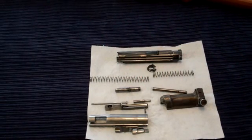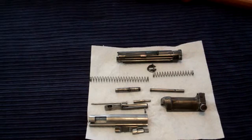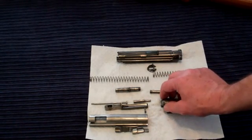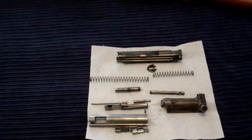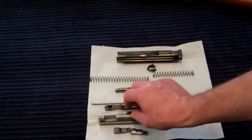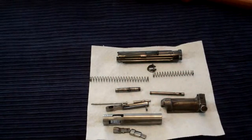So this is your whole assembly — the bolt has been completely field stripped at this point. Now you can do some cleaning and, even more important, inspect all parts for wear and tear, especially breakage, because by the end of the war the material quality was pretty bad and some parts tend to crack under stress. If you shoot your G43 a lot, always inspect the bolt carrier areas and also on the bolt where the locking lugs are operating. In general, look for cracks — very important.